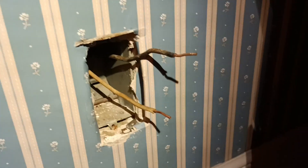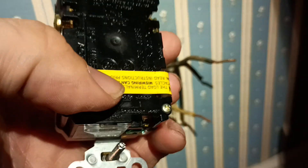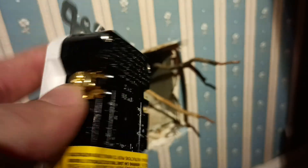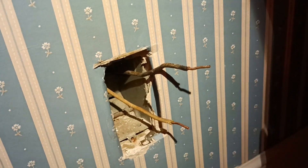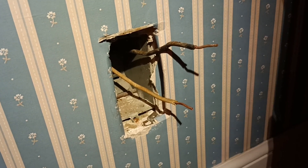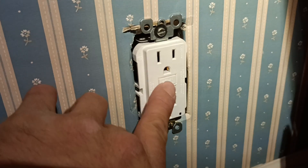We've got the old device removed and the wires stripped and straightened out. We're only going to be using the line side of the GFCI — the load side will just keep the piece of tape on it. The copper-colored screw is going to go to the black wire, and the silver-colored screw is going to go to the white wire, the neutral. Once that's done, tuck it back in the box — and that's pretty much it for this plug. It's back in, installed — go ahead and reset it. We're good to go.